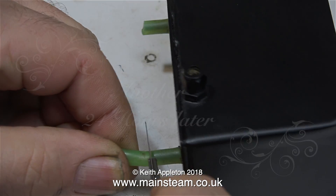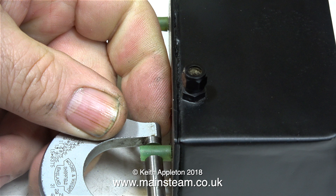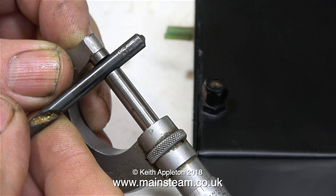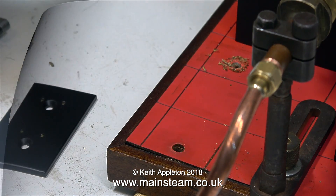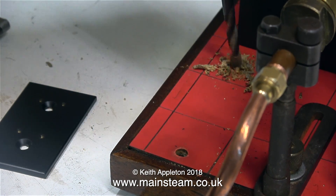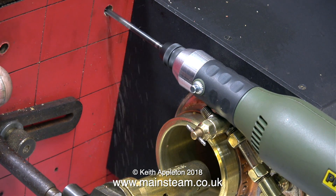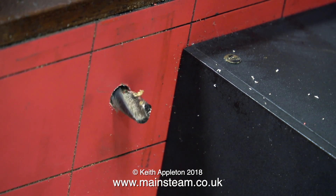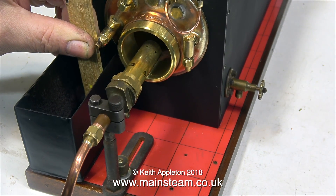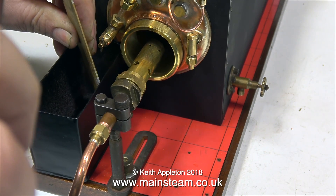Another 24 hours later and the paint is dry, so it's time to fit the components onto the baseboard. I'm fitting some pieces of silicone rubber tubing over the bolts that protrude from the bottom of the tank. Using a micrometer, I'm checking the dimensions, then all I have to do is find a twist drill of the same size — this is a 7/32 of an inch twist drill. This baseboard is covered in Formica, and initially I'm using this twist drill to enlarge the existing holes, but physically I cannot get the drill into the right position on the second hole. I'll drill through the Formica only at a slight angle, then use the smallest of my Proxxon motor tools fitted with a pilot drill to drill all the way through, then drill through from the other side using the 7/32 inch drill. Now the water tank just presses into place — I'm tapping it with a piece of wood and it's a very firm fitting. It's a good way to mount a water tank, because if I need to clean it out, I can just lift it off the baseboard.